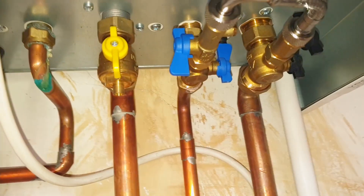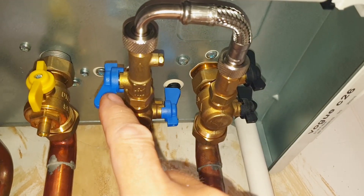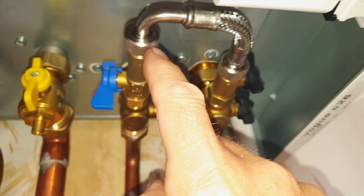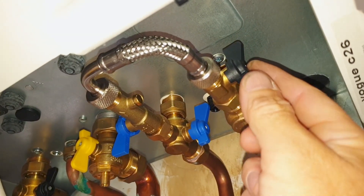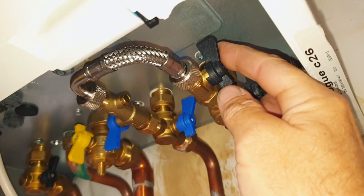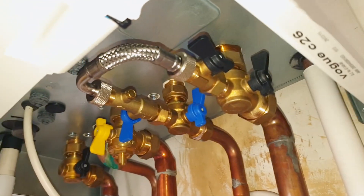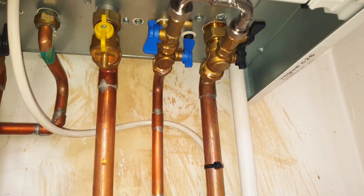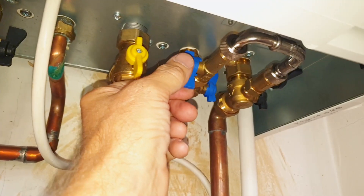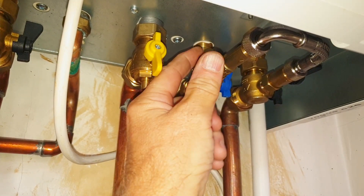What we need to do is open both these valves. It doesn't matter which valve we open first — we just need to open both of them, which will then let some water go into the system through the filling loop into the central heating system, topping the boiler up and getting it working again. I'm going to open this valve here first — you can see I've turned it so it's in line with the valve. Then I'm going to go to the other valve, turn it and open it, and as I do that I'll hear some noise as the water goes through the filling loop and starts topping up the boiler.